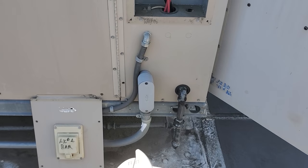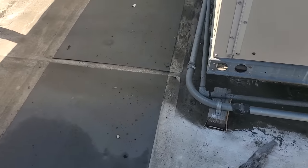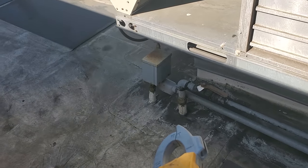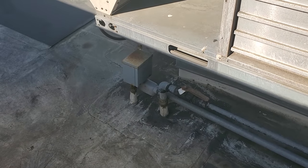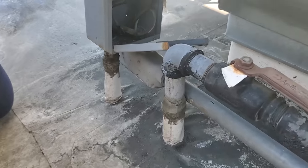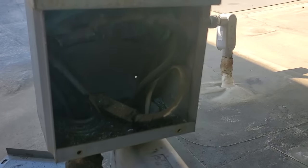We're going to search all of our electrical connection points. We've got an LB right there, and then we come over here and we've got a large junction box right here with an LB on the bottom of it. Let's see if there's any splice points and any potential problems at those splice points. We do have power turned off at the moment. I suspect our problem is in here — and it is.